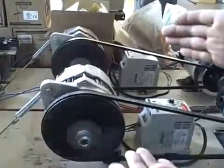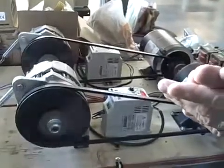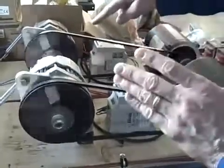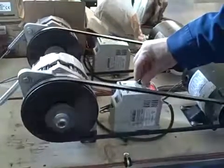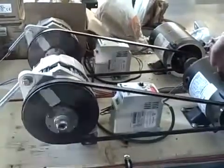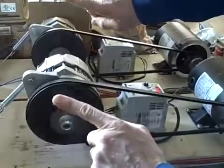That is showing us how these two generators are actually in sync with each other, even though they're being driven by two motors that are trying to go at slightly different speeds. I'm going to take this VFD control and slow it down just a little bit more, from 59.4 Hz to 59.2 Hz. I've turned down the frequency on this induction motor to 59.2, and you can see the two pieces of tape are still staying synced together.